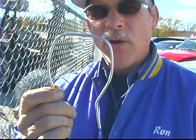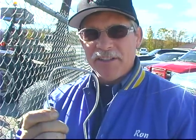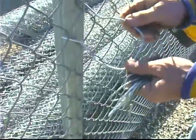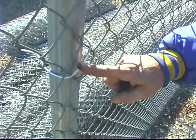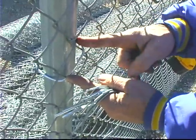The twist tight tie is typically shaped with one side flat, designed to go around one full diamond — two sides of the diamond of the chain link fence. Illustrating how these actually sit on the post: it catches a full diamond, it'll twist usually in the back, and it will draw both wires tight to the post.